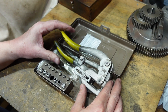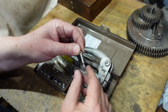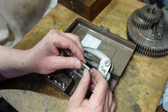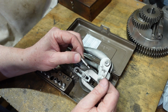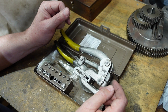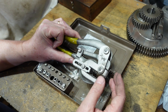The reason I said this might be Roper and Whitney is that I tried buying a small punch from them but it didn't fit. When I measured all the punch diameters, they were all 0.279 of an inch, except for the one that wouldn't fit, which was 0.28. When I went back to Roper and Whitney, the suggestion was made that it's probably not a genuine punch because there were some counterfeits made — apparently you can tell by the yellow handles. I eventually had to grind it down, and an inquiry several weeks ago about whether it's genuine got no answer.